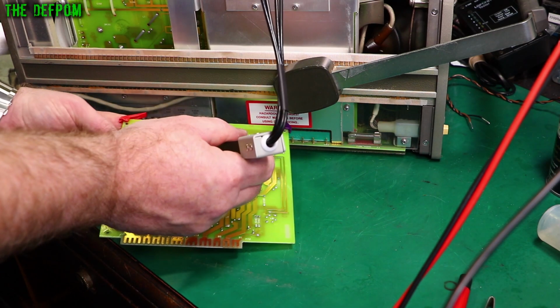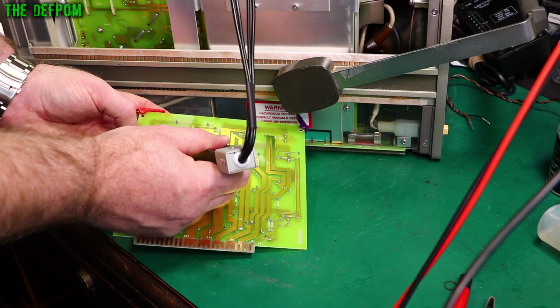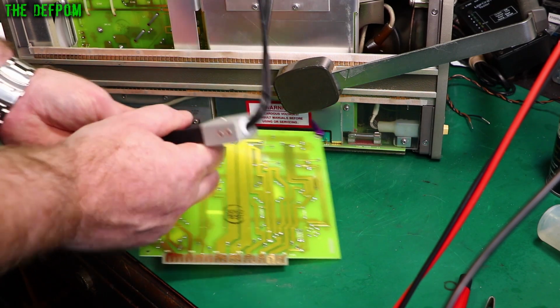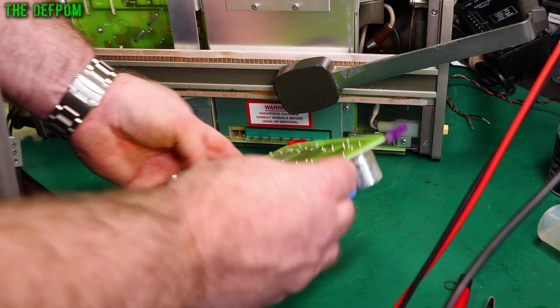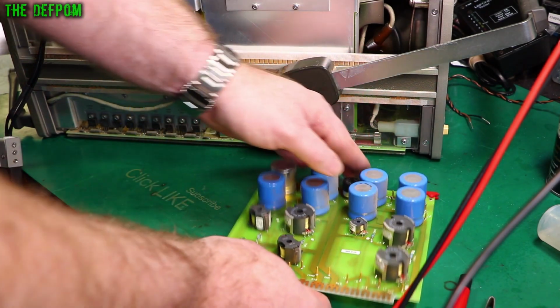0.11. So that one is definitely worse than the rest. 0.08. So that older one, the one that's 2 years older, does appear to be worse. These are 0.03 because they're basically half. Okay, I'm suspicious about this one slightly. Just slightly. So 440 microfarad, 50 volt.